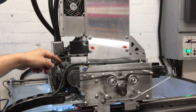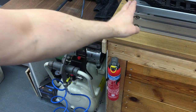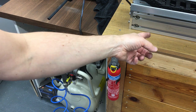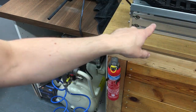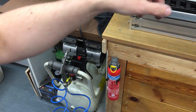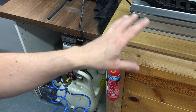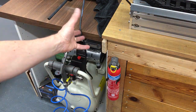Some of the hoses will come down here through the drag chain, all the way down to here, then off the end - compressor's down here. I think what I want is a kind of box of tricks here, so you can either have it running, or have it on auto where the CNC machine puts G-code out to put the mist on. I've also seen some systems where they have a twin line with just high pressure air, so you can blast things out with a momentary push button - that's quite a nice idea.